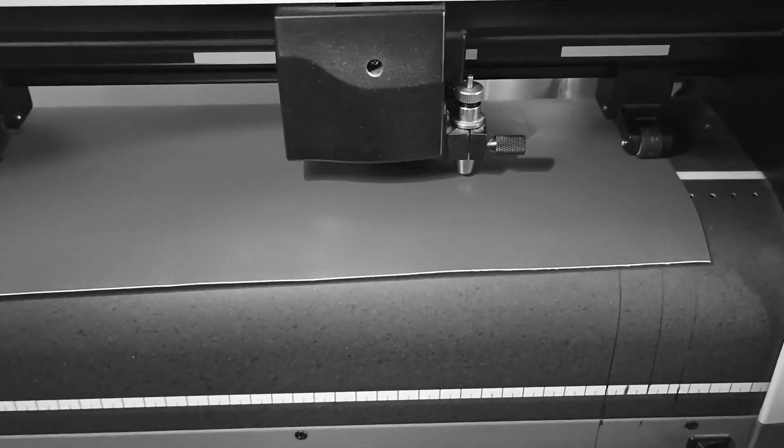For the upgrade, we need PCBs. I drew the boards in EasyEDA, and using a vinyl cutter and adhesive foil, I made stickers that will be used as a resist layer for manual etching.